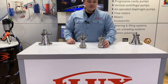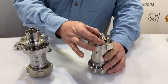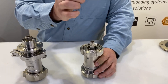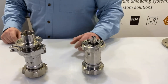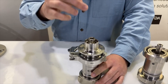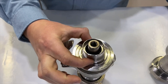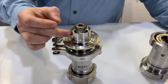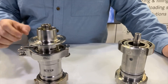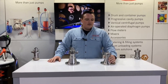Now we'll take a look at the individual gearboxes. On the F560, the pump shaft threads directly into the gearbox shaft, and the mechanical seal is installed in the centering disc and stacked on top. On the Visco Power, the gearbox shaft is similarly threaded and the pump shaft threads directly in after the seal is assembled. However, you can see the difference with the extension on the motor connection piece — the seal sits lower and more in the flow path of the fluid, which creates better lubrication for the seal.